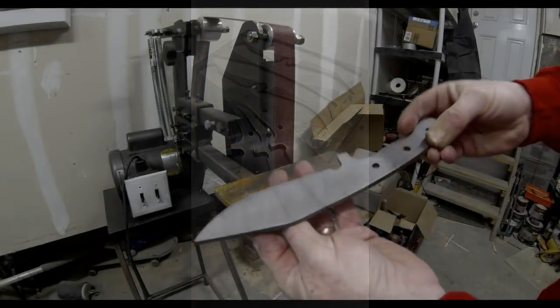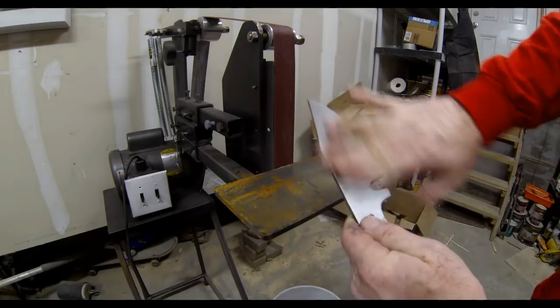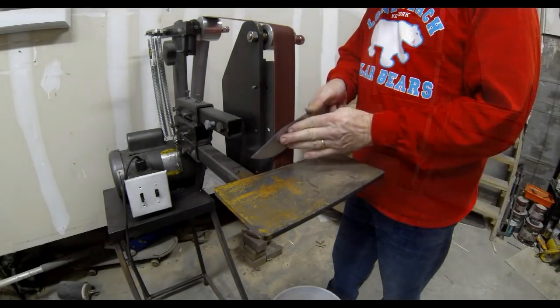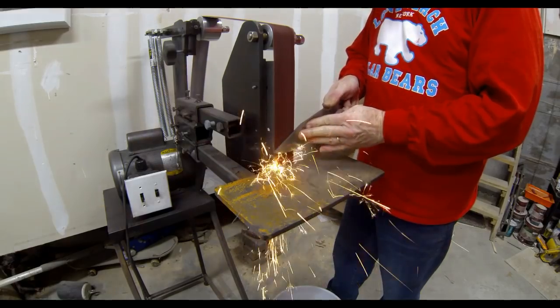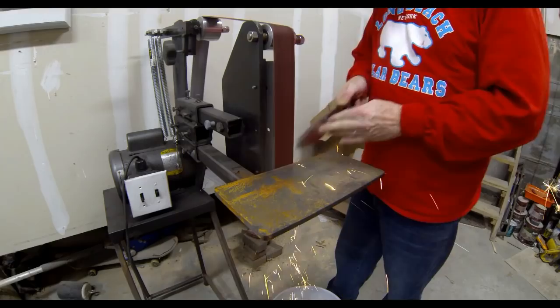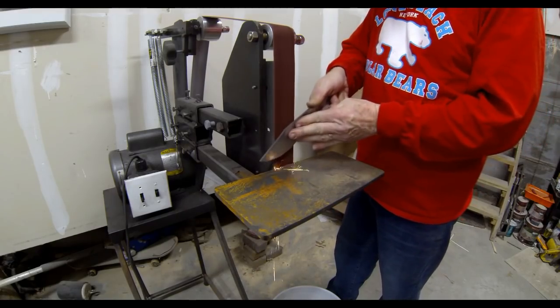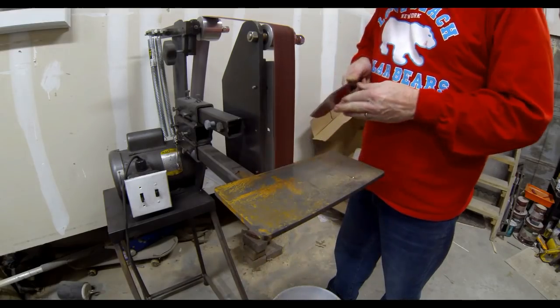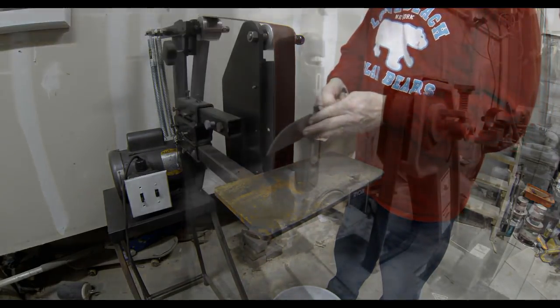They can play around with the shape of the knife, even with the handle a little bit. You can put guards on, or you can leave it without guards. Of course, you could always do spine work, etc. The process starts just by grinding down both sides of the knife so that the tip comes to a point. You can do this on a belt sander — I'm using a 2x72, though I actually finished it up on my 4-inch belt sander.